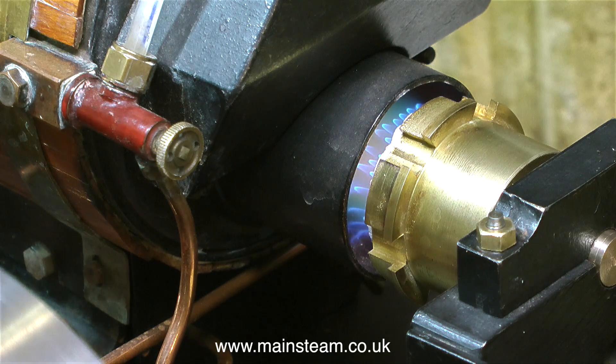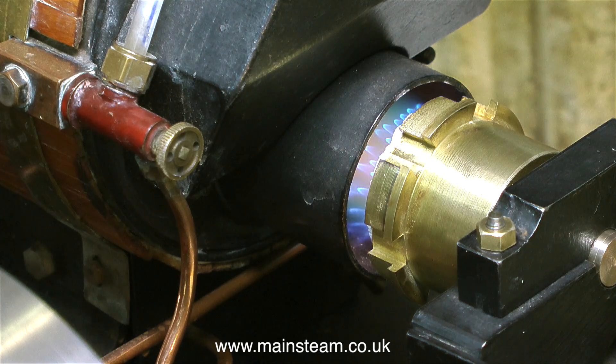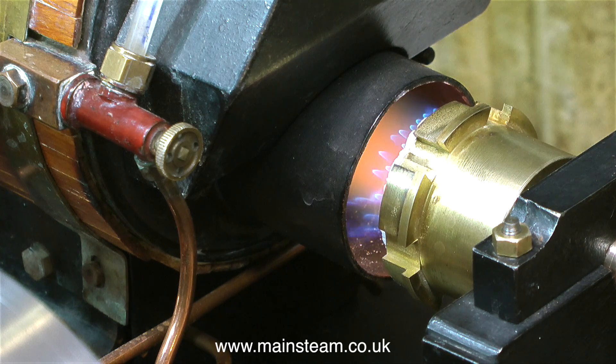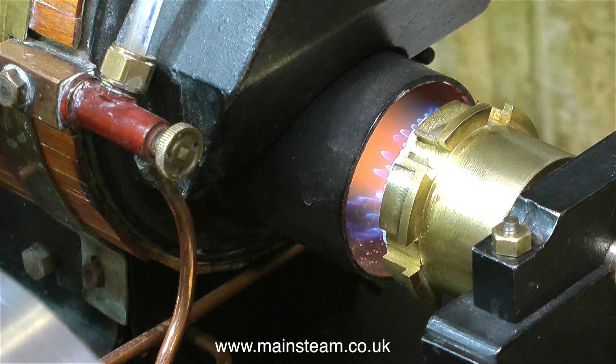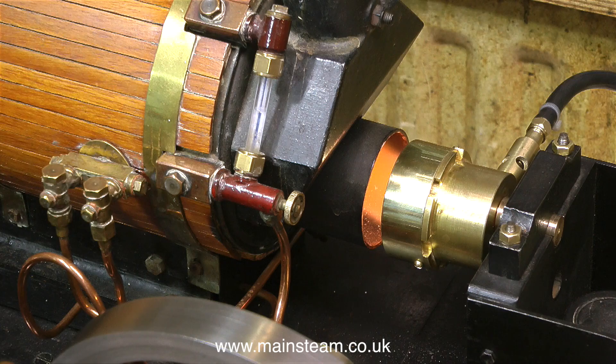For this Victoria mill engine to run at a realistic speed, whether it's driving anything or not, it doesn't need that much pressure — 30 pounds per square inch is more than adequate. Provided that I don't put the ceramic burner too close to the fire hole, it's not going to sing. When the howling starts, the flames take on an entirely different appearance. I used a piece of brass tube to cover the end of the burner and make it look tidier, fastened with two 6BA bolts, and I think the overall effect is quite pleasing. I quite like the warm glow in the fire tube. But best of all, I like the silence — no great noise to speak of.